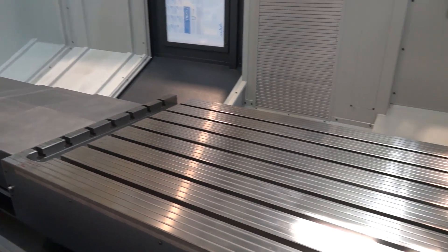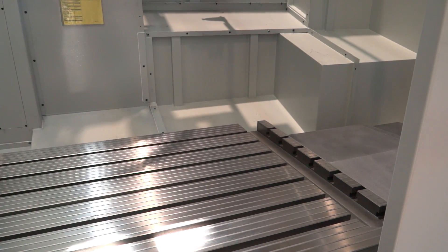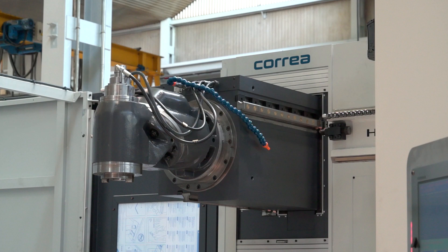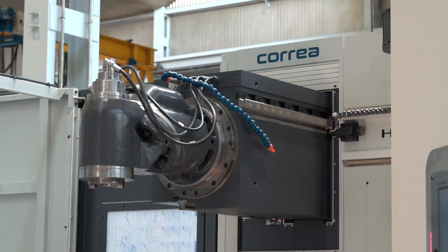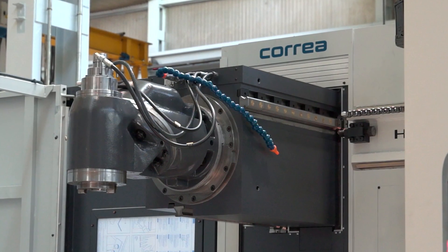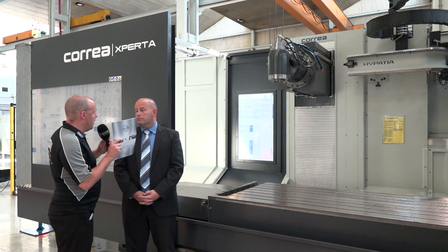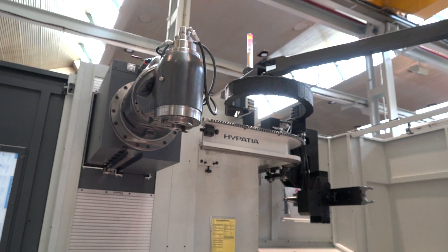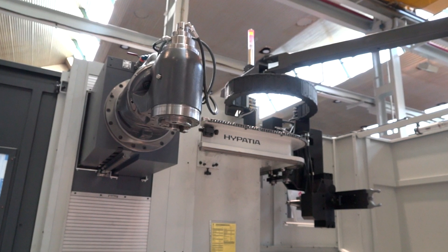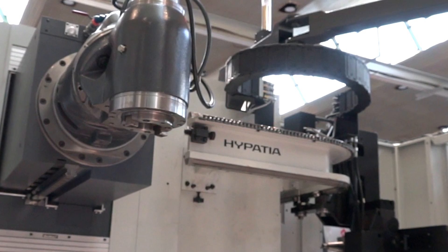When you say cost, is this a machine that is significantly compromised in its quality? Certainly not. The fundamentals of this machine are based on the Norma — it's a system machine, so it is still a very robust and well built machine. The head on this machine is the U22 head, which is actually a manual head — not so popular now in the UK market, but we have four different types on this machine. It is a 50 taper machine, and we can go up to 60 tools on this machine, or as low as eight tools if needed.